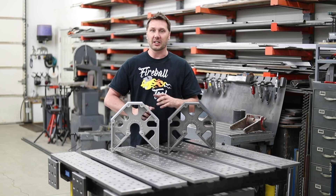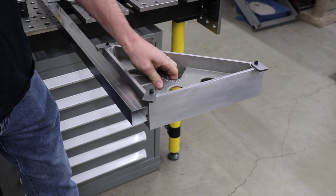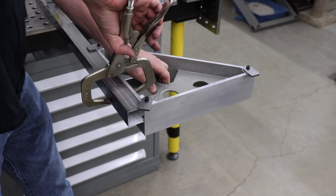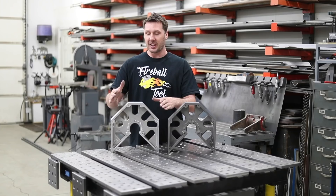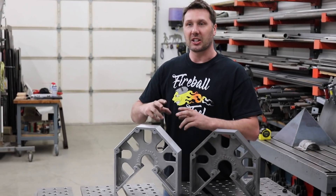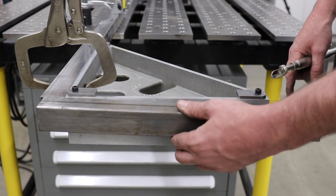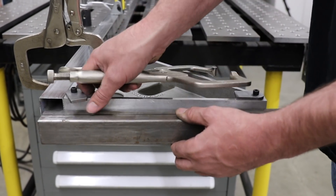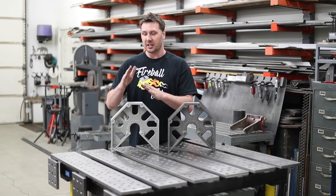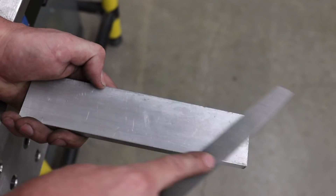Aluminum is very light for obvious reasons, so I like to use it off the welding table. I like to use it on sawhorses, if I'm building on the floor, or maybe I've got to climb a ladder and I can carry it up with me. It is also extremely resilient to weld spatter. Two, it's a gigantic heat sink, so if you're welding thinner material you can clamp to it and it pulls the heat out — if you're working with sheet metal, it's great at that too. And it's forgiving, so if you were to get a ding or dent, it's easily filable.